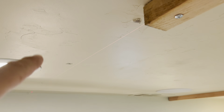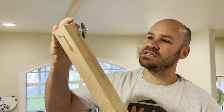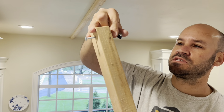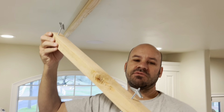When drilling the half-inch holes, go nice and slow. You don't want to go through too far and accidentally hit ducting, a vent pipe, or a water pipe. Make sure when you pre-drill for the toggle bolts it's big enough that the shank will slide in and out freely, because if it's too tight it'll thread into the wood and make it difficult when you're trying to attach everything.